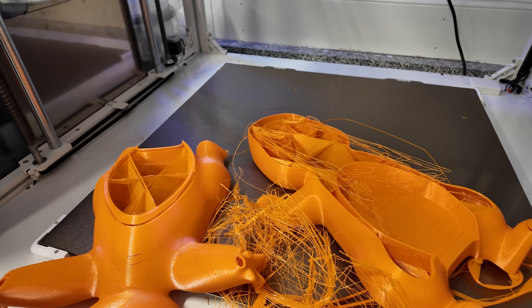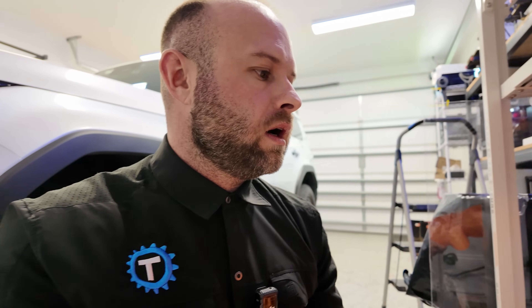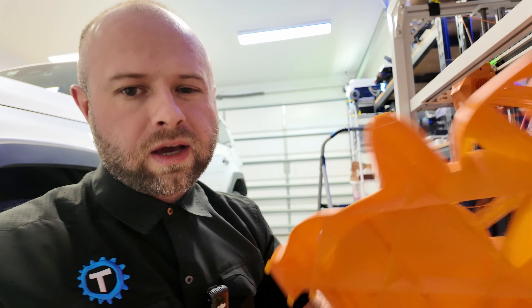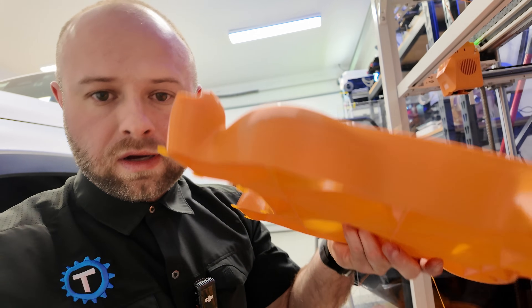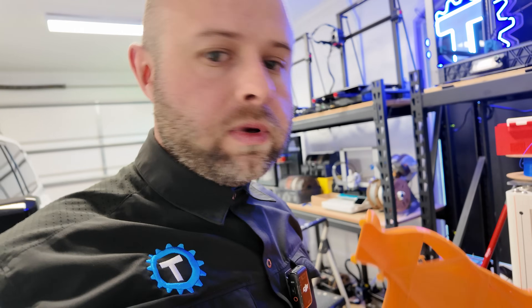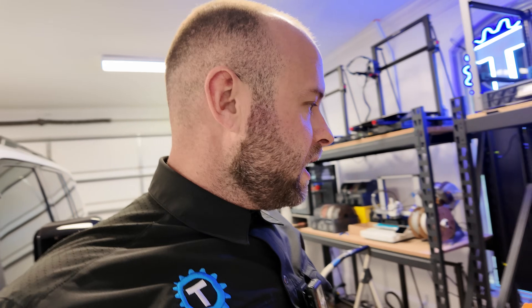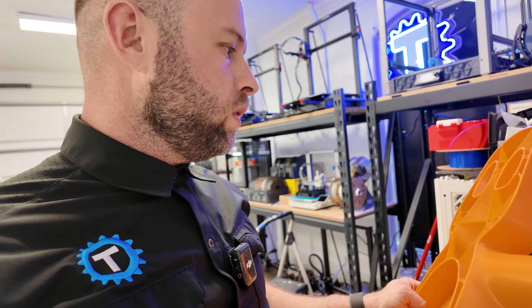This extruder is sized to pull five-kilo spools through a pulley off the floor - I've seen plenty of people do that. So I'm thinking it is a problem with the extruder itself. This is burning a lot of filament to troubleshoot. Maybe it's file corruption or I could do a better job on the slice with more wall loops. The first 100-200 layers look great and then it just completely whiffs. It happens at different layers - it just gets to a point and then everything goes wrong. I've looked around the machine for any signs of it bumping into anything at a certain height and it just doesn't make sense.